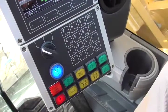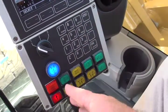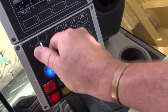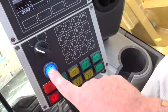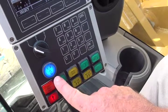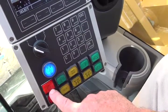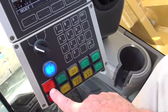The lower portion of the IMT computer's display contains buttons that control various functions. Firstly, you have the rotary speed function which determines which drilling speed is selected, and a high speed spin-off button which switches between your low drilling speed and your high speed spin-off. The filter indicator light indicates when the IMT filter is blocked and due for maintenance.